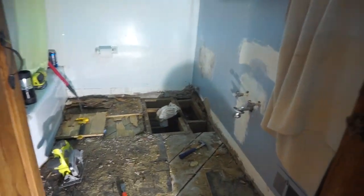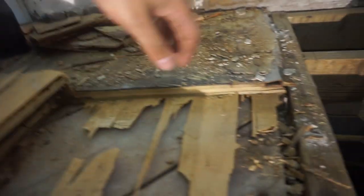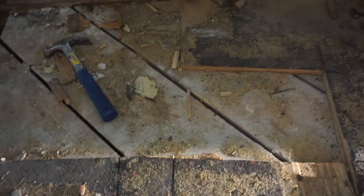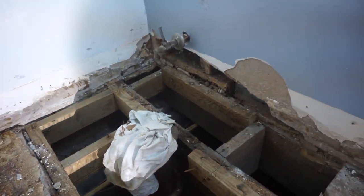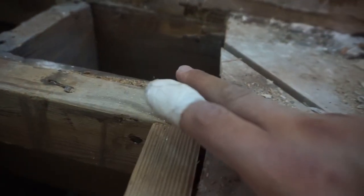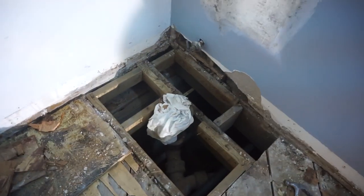Remember the last scene — there was a bathroom, there was a toilet. Now there's no subfloor. To get this plywood out we had to use a circular saw to cut an inch in and just pry it out. There's the original subfloor. We assume this must have rotted at one point and they repaired it by putting two-by-fours at subfloor height, but it started sagging — that's why the floor was sagging where the toilet was. It's garbage, but I'll fix it.